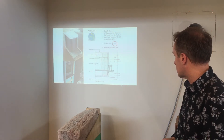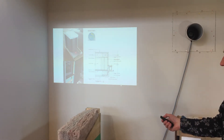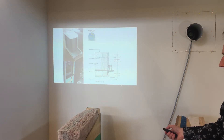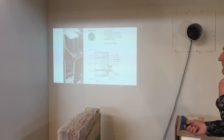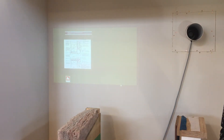In terms of the thermal performance of the window, the key things are: first, recessing it. The standard New Zealand detail — from research across 300 homes in Auckland, Hamilton and Christchurch — found that 299 of those homes had flush-mounted aluminium standard double-glazed windows. Not thermally broken. Not Low-E. They followed the New Zealand Building Code detail where the window is mounted overlapping the cladding on the outside.